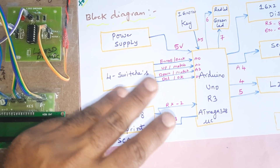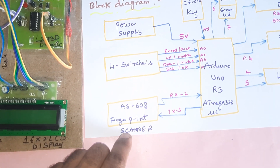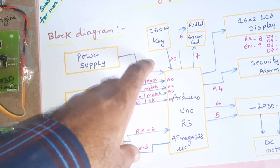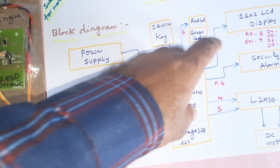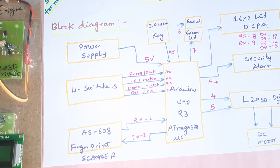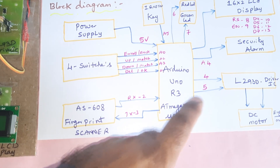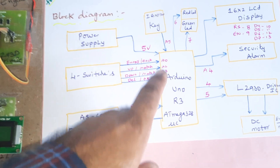You can create IDs: ID0, ID1, ID2, and so on. The AS608 fingerprint module has RX and TX pins connected to the second and third pins. The ignition key is connected to the fifth pin. Red LED and green LED are connected to pins 6 and 7. The 16x2 LCD display is connected with RS, Enable, D4, D5, D6, D7 on pins 8 through 13. There is one security alarm — if the fingerprint is wrong, the red LED and alarm turn on.